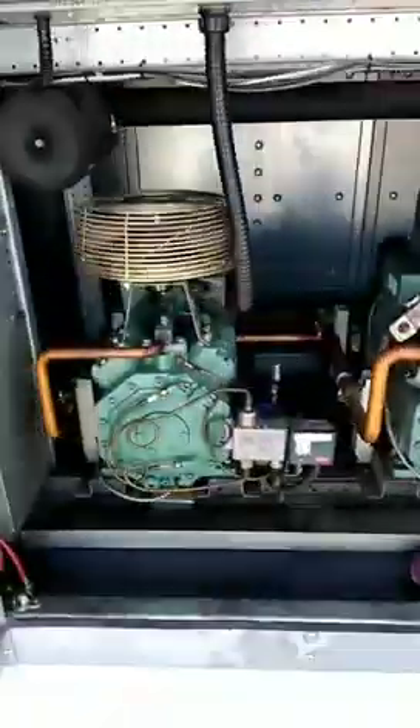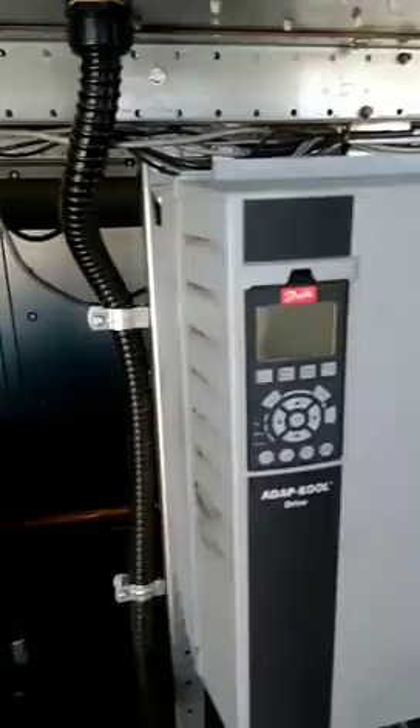What you can do is just shut the suction, allow the liquid to fill in the store — you don't have to shut them for too long — then open them quick. These have a double riser. Sometimes if you have the suction lower and you're pumping the oil or liquid into the store, you can push some of the refrigerant and oil back up to the rack. I think somebody at one time replaced compressor one and it may have been a burnout. You can see this runs off the VFD.